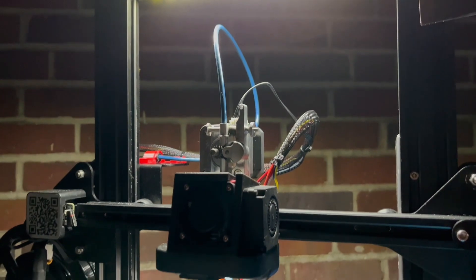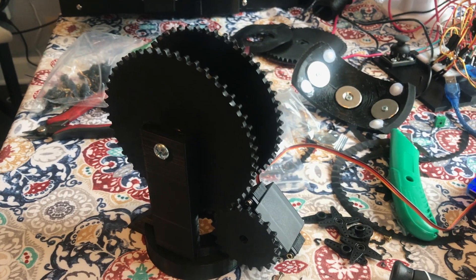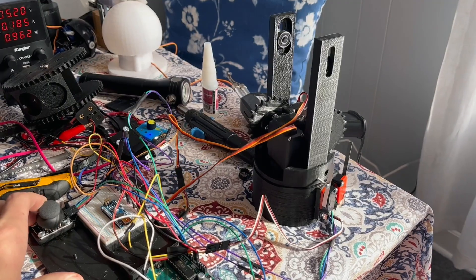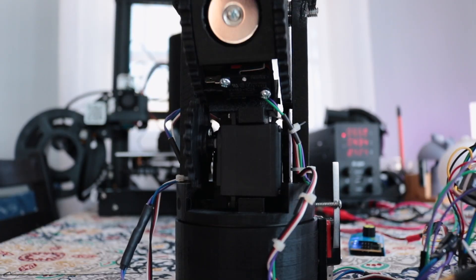We also installed some LED lights — if you want to check out that video, I'll link it in the description. One of the bigger changes we've made to this robot is adding bearings to a lot of the moving surfaces, to make it so they're not plastic on plastic. An issue from the previous build we're going to fix today: when the puck goes to the edge, I want it to stop — so let's put some micro switches in here, program that into the Arduino Uno, and get some good code happening.